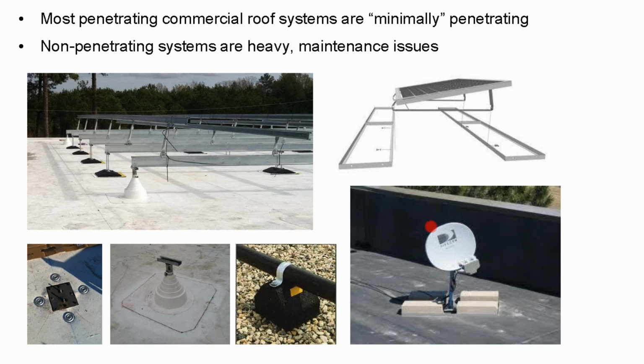Well, the solar installer that doesn't have any roofing experience certainly doesn't have any commercial roofing experience. So the last thing they want to do is poke a bunch of holes in a flat roof, especially when you go on these flat rooftops. Not all the water makes it to the drain. So on these flat roofs, you can get lakes of water on the array. Now, these ballasted systems only sit like an inch above the roof deck. So putting a system that's only 1 inch above the roof deck will accumulate water, that's not a very good idea either. I like elevated ballasted systems.